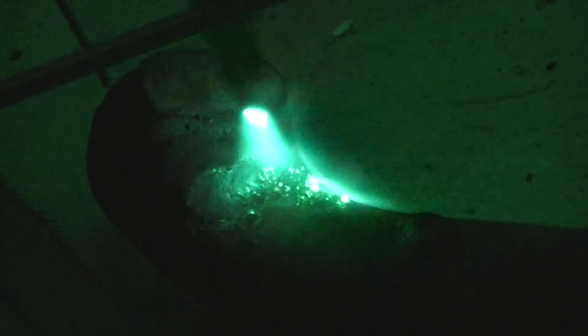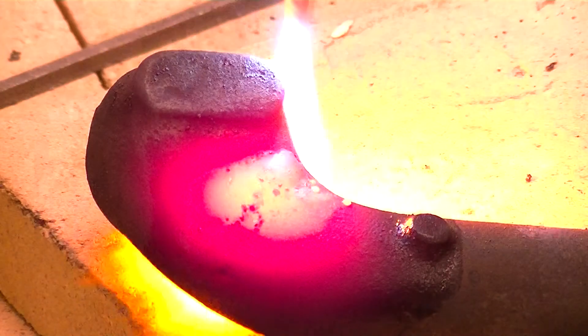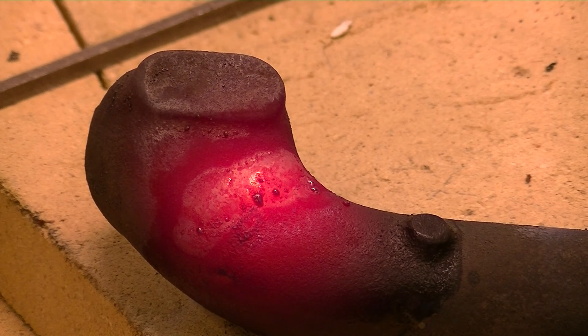Because we've used the torch, this will allow the weld to expand and contract — heat and cool every time — without getting a crack in it. It won't be anything like nickel rods used with arc welders and MIG welding. This will be a nice soft, easy-to-work weld. We're just going to let it cool down now, let it sit naturally, and we'll be able to clean that up and take a look at it later on.